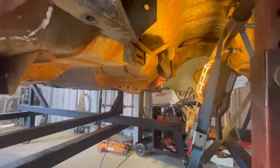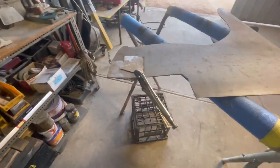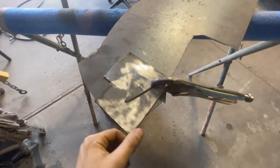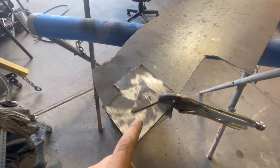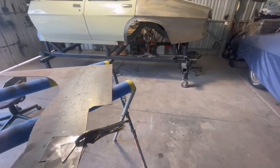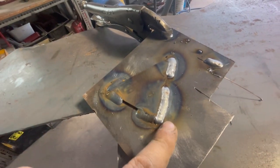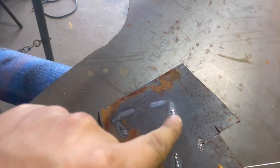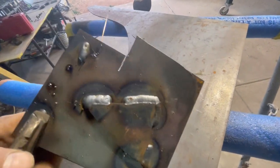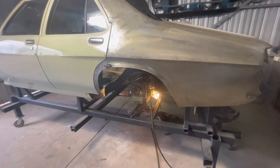I've got my areas all prepped up and ready to be welded. Because what I'm welding is three mil to 1.6, I've gone out to the scrap yard and done some test welds on similar material - a bit of 1.6 and an off-cut of three mil. I've cleaned them up and set the welder up. Here are my test welds - that's the setting I chose to work on the car. Pretty good penetration results - 1.6 on the bottom, three mil on top.